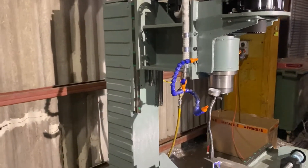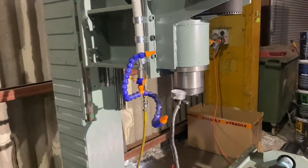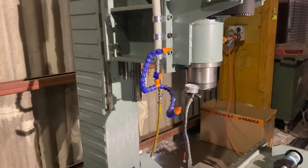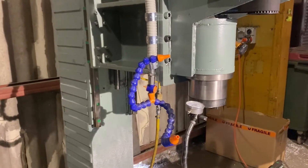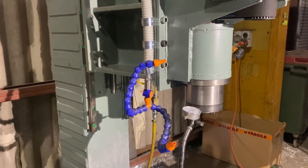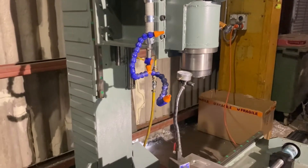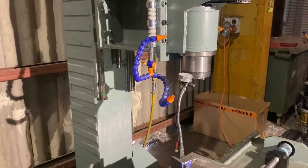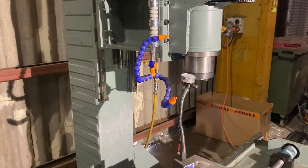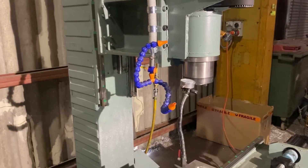The whole Z column there is filled with epoxy granite, and the base is filled with epoxy granite, so it's about 400 kilos worth there. When I first designed it, I sort of checked the deflection of the head — I'm probably pushing with about 50 to 80 kilos worth of force there. Initially I noticed there was a little bit of deflection, so I braced it, checked it, and then wasn't happy with it, so I filled it with epoxy granite. In this video I'll chuck in the videos of me testing it as well.